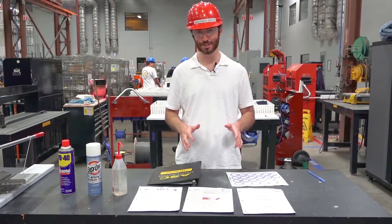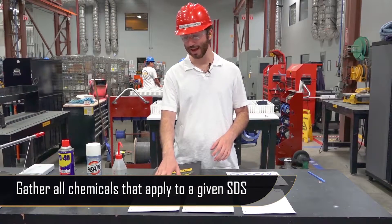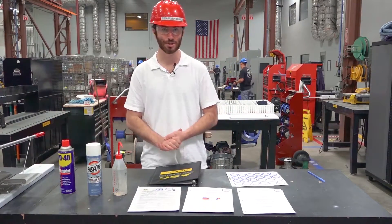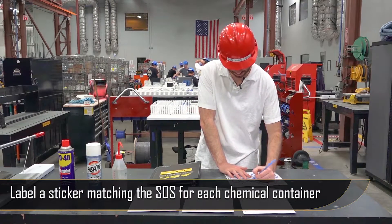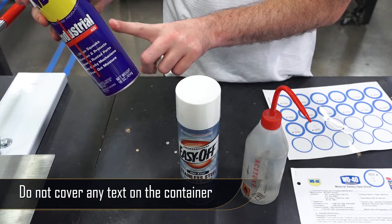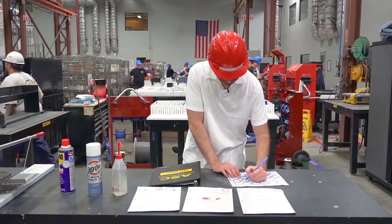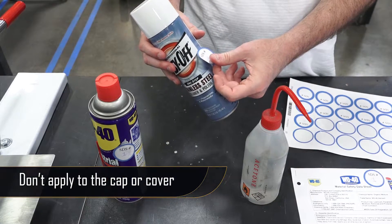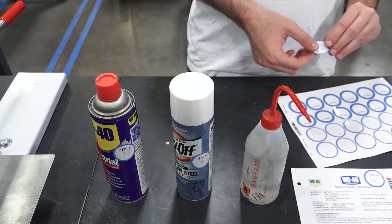Here's where the new system comes into play. Now that these safety data sheets are labeled one, two, and three, I'm going to get all the chemicals that apply to a given safety data sheet. So let's take WD-40 — I'm going to get all my cans of WD-40. I have one can of WD-40, so I'm going to write number one on one sticker, take my sticker, and apply that to the can of WD-40. Importantly, don't cover any of the text on the can. Then I'm going to do the same for EZ-OFF and acetone by writing the numbers two and three. When you're applying the sticker, don't apply it on the cap or cover of the chemical — apply it directly to the bottle because caps can go missing. And number three goes on my bottle of acetone.